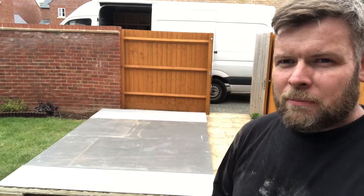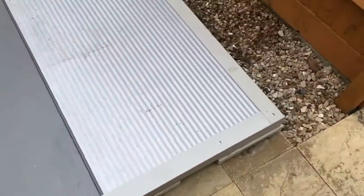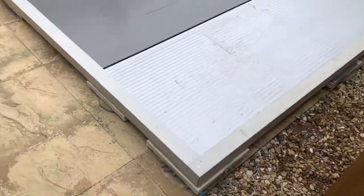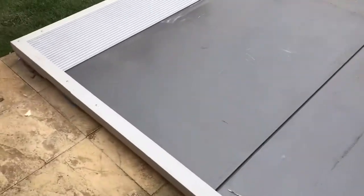If the panels aren't quite level, a little bit of packing up with some composite material might be needed. The next stage of this base will be to wrap all the edges up in metal — one, to protect the foam, and two, to give it a 90 degree angle on there so there's no danger of compression. So we've just wrapped around all the edges of the panels in a 90 degree bend metal flashing, to protect the edges and create that 90 degree bend so there's no danger of the walls crushing the edges of the panels.